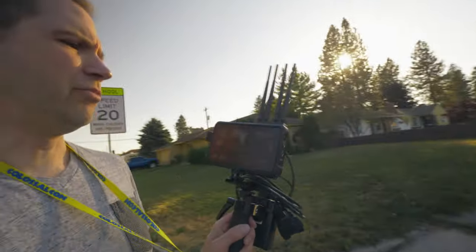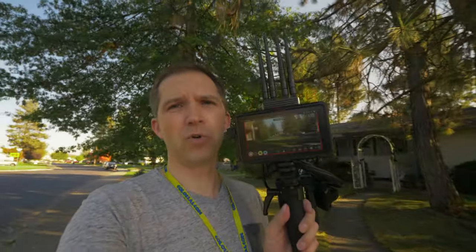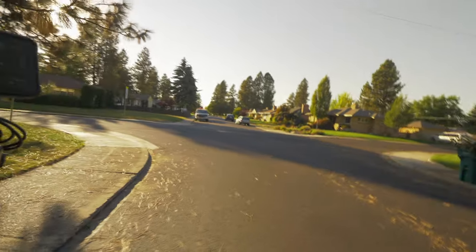I'm a block away and seeing some hits, probably because I'm behind a van that's blocking the path — but it's working. I'm well away from where I started, and it's just fine. This isn't what I'd call a super congested Wi-Fi area, but there's enough Wi-Fi here to give it a good test, and it seems to be working just fine. There is some delay noticeable at this distance — not ideal for pulling focus from here, though as a focus puller you'd want to be closer to the action anyway. The system has four antennas, meaning it's transmitting on four different frequencies, so if any one has interference it'll skip to another that doesn't.